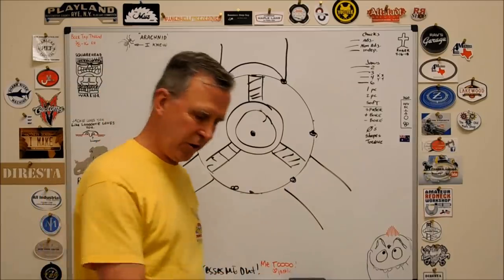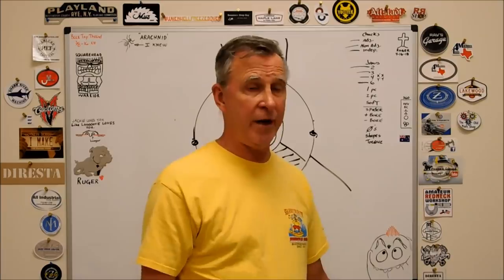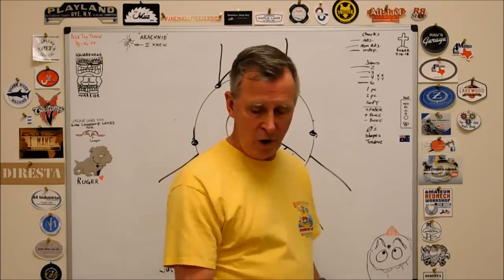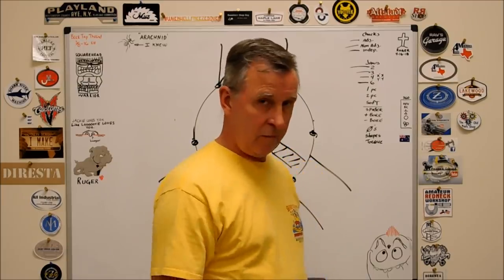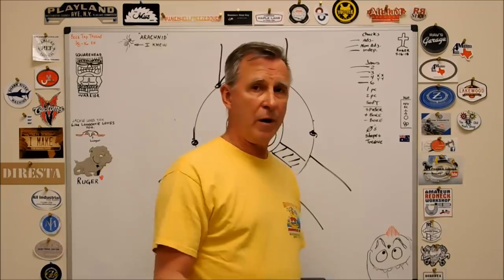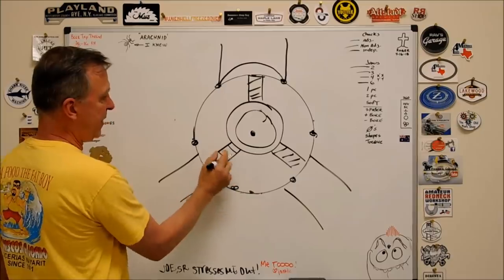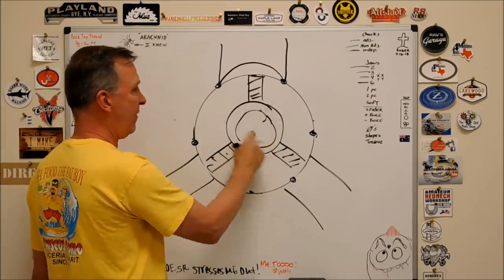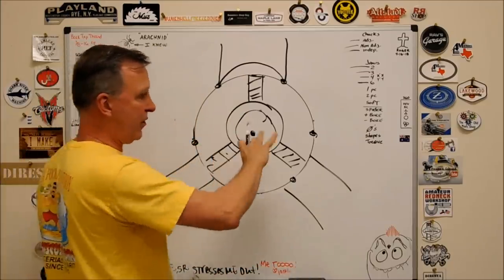Look at the reading on your dials, because it's just like any other boring operation. There's going to be a setting or reading on your dial. If you know what reading it was that allowed that part to go in, record it. That's where you don't want to go. You want to stay a couple thou away from that now. Open your jaws, take one or two, it doesn't really matter. One works just fine. This does not have to run concentric for boring soft jaws. Dial it in a half a turn and close.